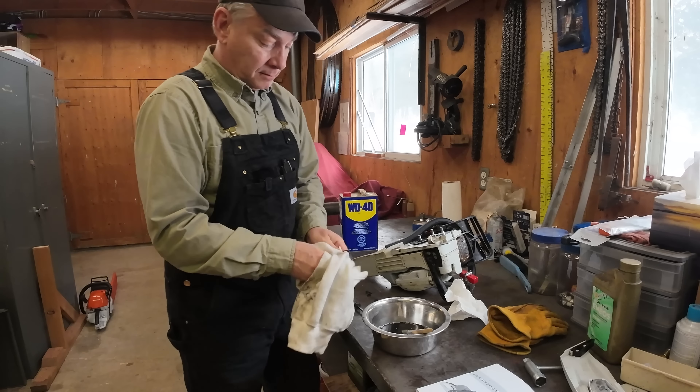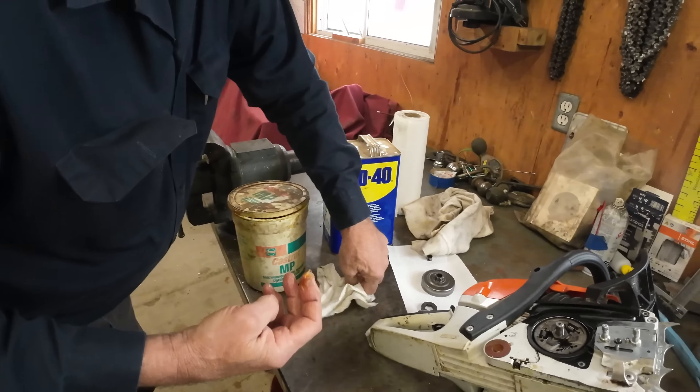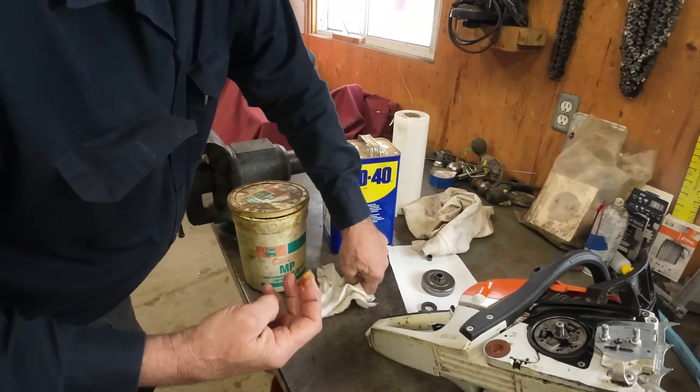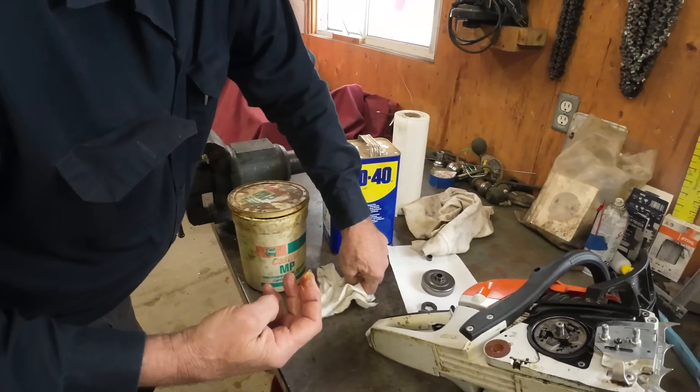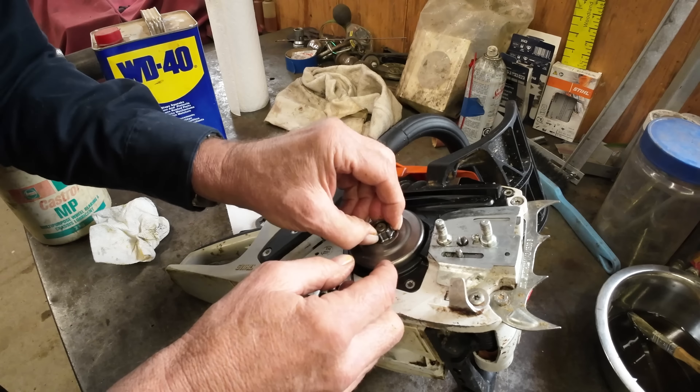Other than that I think we're all right. WD-40 — it's good for anything. We've got a little bit in there and all I'm going to do is brush this in there to clean it out. There's a lot of black stuff in there. I think what I'll do is when I'm back in the city, I'll just drop by the chainsaw clinic and let him take a look at that sprocket — and if he thinks I need a new one, I'll just pop it on. There's one tiny little bearing in there.